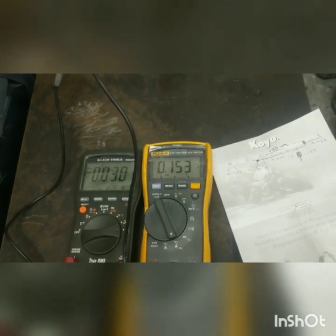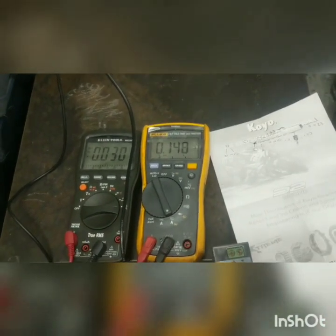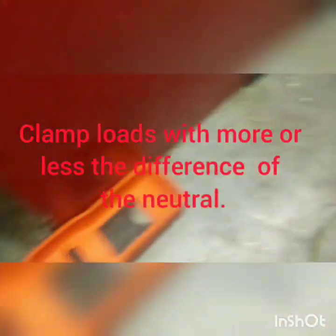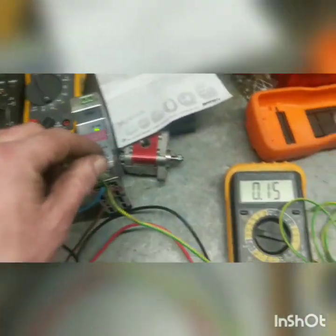The current from the live side isn't really rising at all. The current on the neutral side is, and also the current obviously going through the corresponding earth.